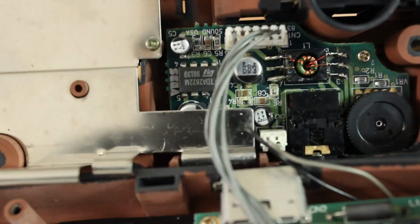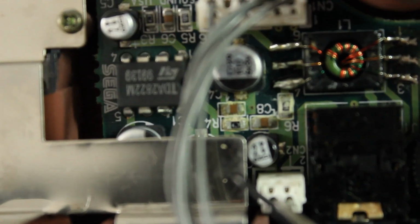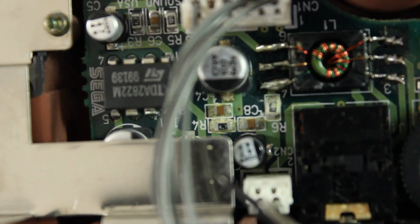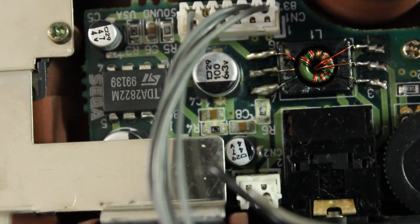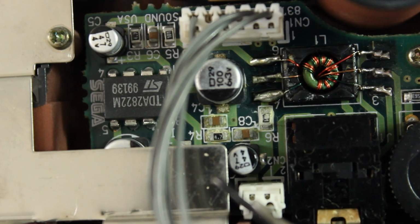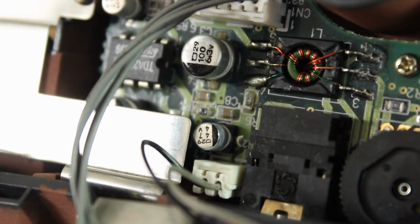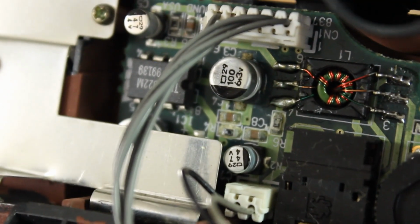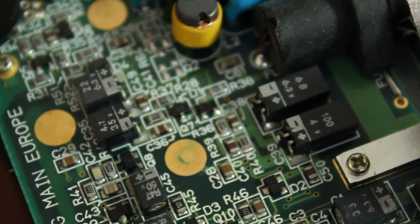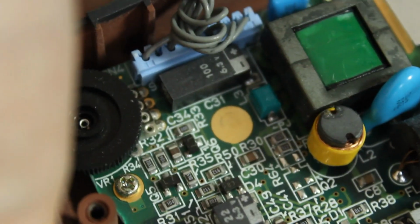And then this is my main concern. When I said the audio board, you could hear noise. Well, if you see that there, you can see that some of the resistors have got corrosion on the contacts. I think that would actually be from the capacitors leaking, so that's going to be the issue for this one. Hopefully replacing the ones on the main board will fix the screen issues, just to help clear that up a little bit.